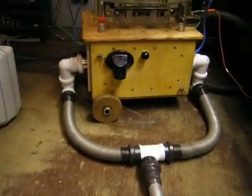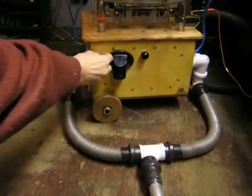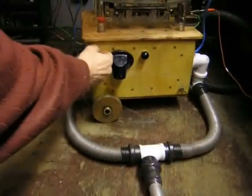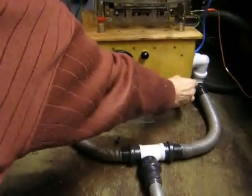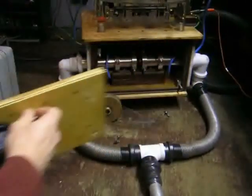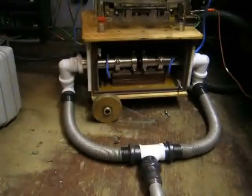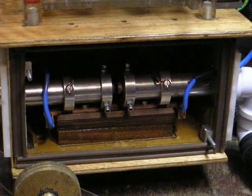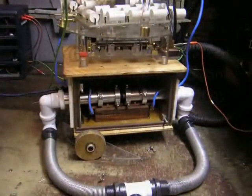This is my own 4.7 inch 1kVA coil running on two 10k NSTs. The cap bank is 22nF with a 193 thou suction spark gap. The two hoses connect to a heavy duty vacuum cleaner with the air going in via the front inlet. This all means the gap is fairly quiet in operation but still only gets hand warm after five minutes of running.